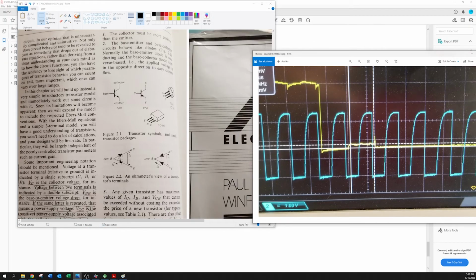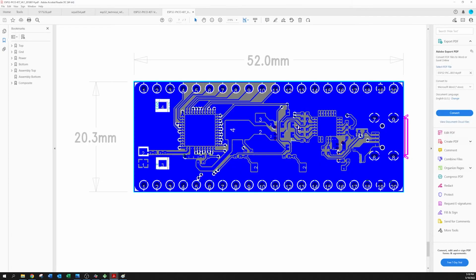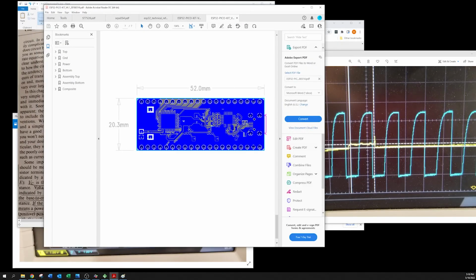So I stopped debugging at this point. At this point, I was like, okay, I've done my root cause analysis. I've fixed the problem. I know where the problem, at least I have a good idea where the problem came from. I'm happy, right? So I'm very confident, and this transistor is the only place it could be getting power. And by the way, I did verify that once I cut this line, I did another calculation. We could look at it on the bench, but suffice it to say, it looks like the SCL line now. Now there's like 50 k ohm or so resistance on the SDA line.